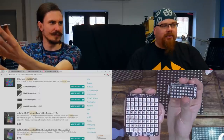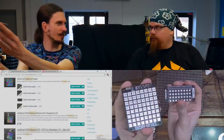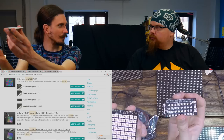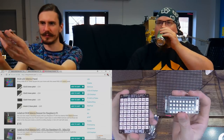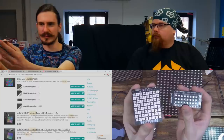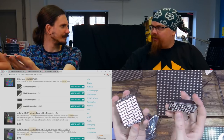Yeah. So both of these are run from the WS2812-based driver. This uses a rather complicated method of driving. Actually, there's no real method to drive pixels on the Pi that isn't complicated, really. There is an inherently difficult problem because trying to update 16, 32, 64, 128, and maybe even thousands of pixels is just a hard problem if you want to do it at any decent refresh rate. And these need a fairly constant refresh rate, don't they?